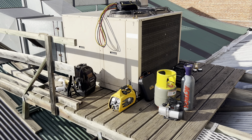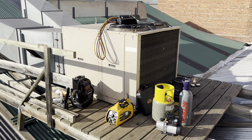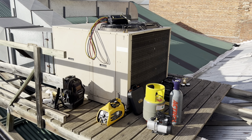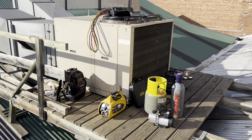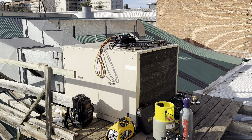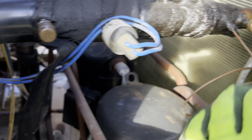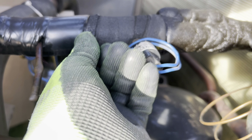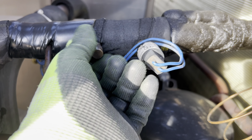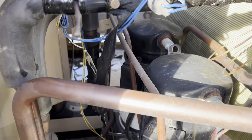We are back to do that leak search. Fairly confident the leak is that Schrader core depressor there — we already confirmed it was leaking — but we'll go over everything else, pull out the gas, see how short we are. It's R22, so we can just pull that and reuse it, pump up with nitro, back it and get this thing up and running, then dial in that superheat. Just doing a bit of a visual — obviously we know that one's leaking, but this one here is incredibly oily too. I've got Schrader cores here so I'm going to go ahead and replace them all anyway.